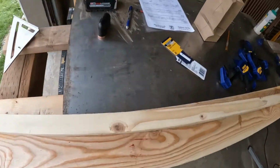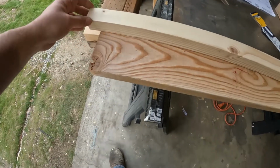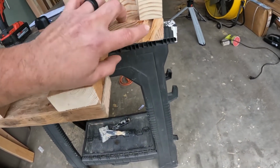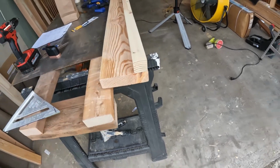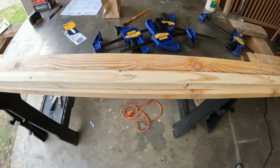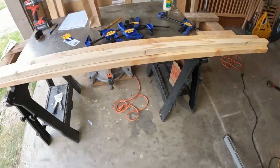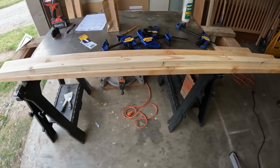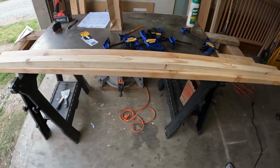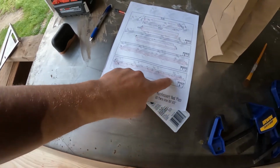Because of where we're putting these screws, see we got one spaced every 12 inches. I'm gonna make sure that this is the bottom, right? Because that's gonna make wood filling that significantly easier. And the wood glue there is gonna make that edge nice and tight. So I'm gonna clamp this guy down and we're gonna paint it with wood glue, clamp it down, start pre-drilling to get our, was it 7 holes? 1, 2, 3, 4, 5, 6.